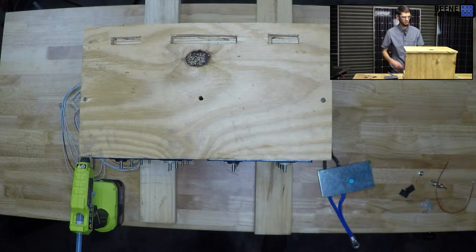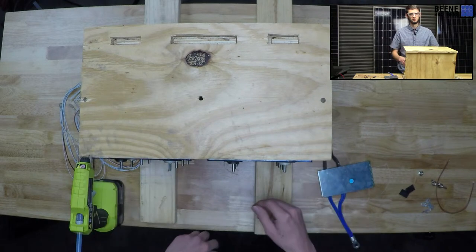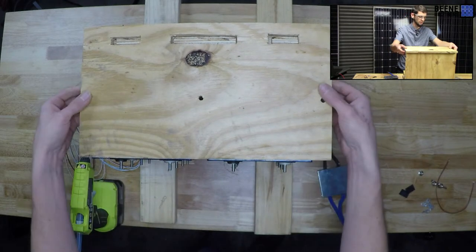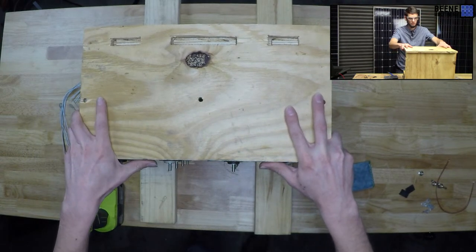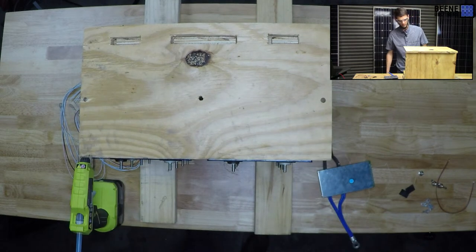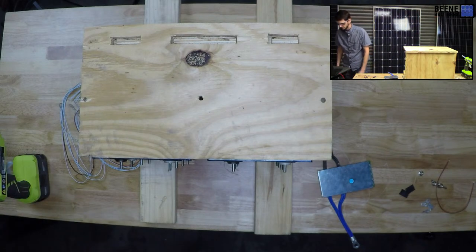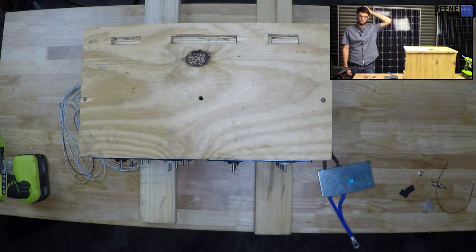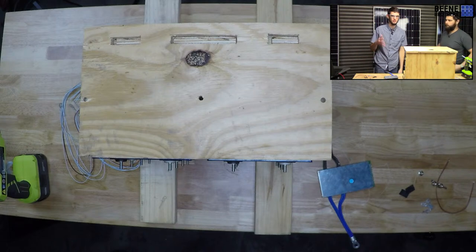I'm not sure what the Sharps are. We'll get some in, and we'll actually do some full sun tests with the Sharps to see what open circuit voltage they're putting out with our multimeter, so you can get an idea, with the open circuit voltage and short circuit current, of possibly what kind of condition they're in. A spec question? Yeah. The Sharps are 60 cells, so they should be about 39 by 65 inches, but they're not here yet, so I haven't taken a tape measure to them. But a 60 cell is usually about 39 by 65.